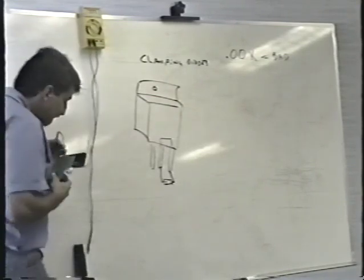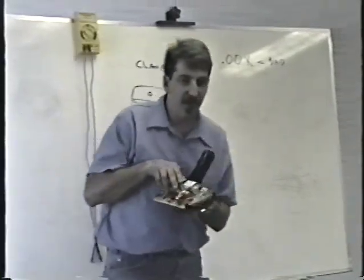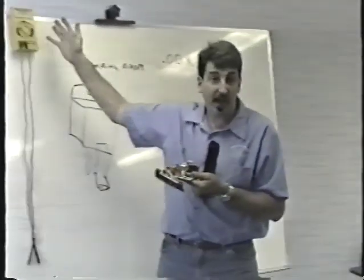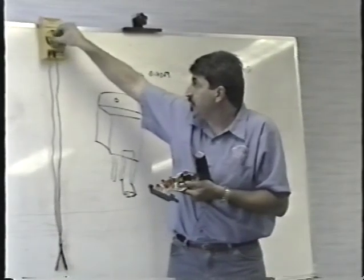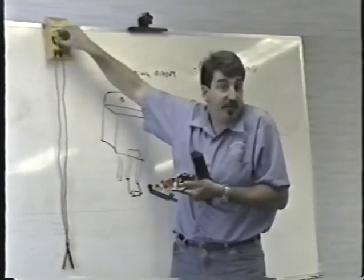No, it's bad. This little blue capacitor here is part of the AC line filter. It's going right across the power line, and it's definitely shorted. Check that in diode setting. No, on ohms. Well, it is on the diode check setting now, and obviously it's shorted, but you would probably check it on ohms, really, 200 ohms. And it should be open. You should not see a short circuit there.